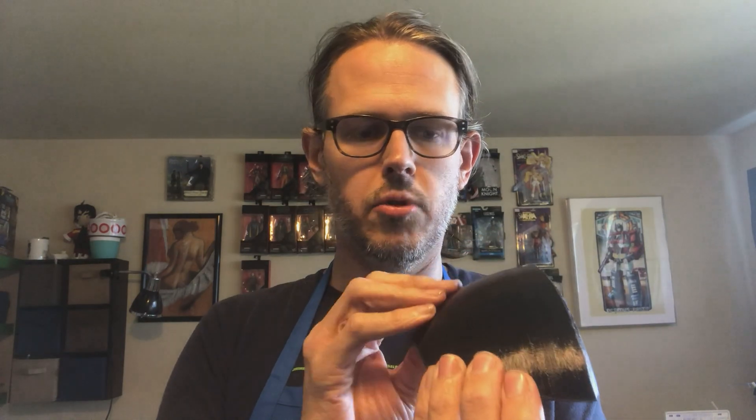When I'm printing helmets and masks I like to chop off the top. I usually print it upside down to get it nice and smooth — you can see how nice that is, it's gonna take hardly any finish work. Then I can print the top of the helmet the other way and get a nice smooth finish. This one just has a ridge down the middle of the back, so that's why it's in a bunch of pieces. I'm gonna show you how I weld 3D prints together to get a good, nice bond and make it back into a solid piece.